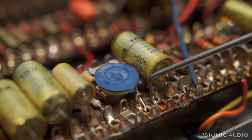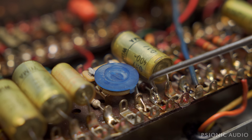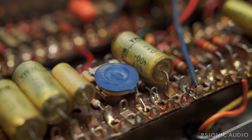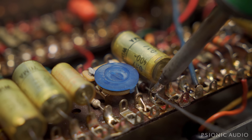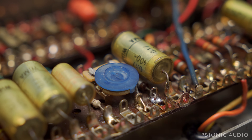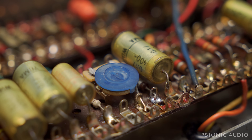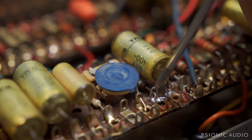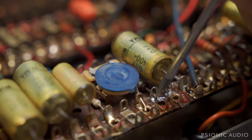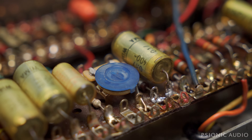I'll be going through the amp and finding all the little things, like where this resistor was replaced but was never soldered — and that is one of the reasons that Vibe trim yesterday sounded so wonky. I'll be revisiting this area in a little while. Fiddling with it, I discovered that solder will not stick because it's so tarnished, and its neighbor's solder joint is also not very great. So I want to get in here and clean and burnish that area on that resistor and give that resistor a little bit of a bend.